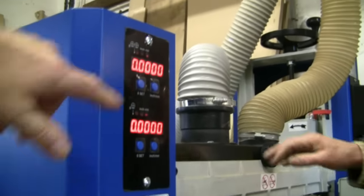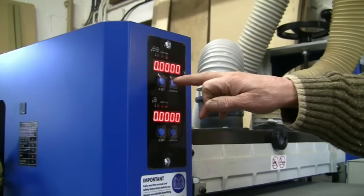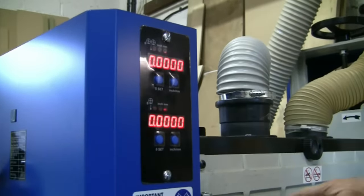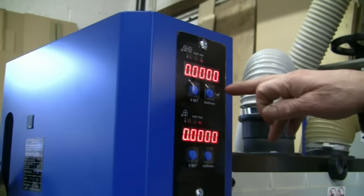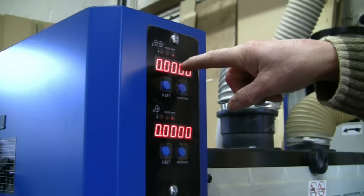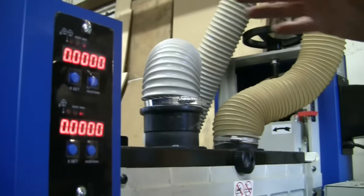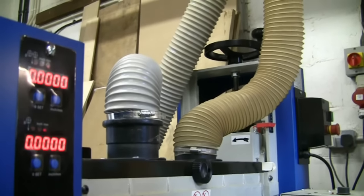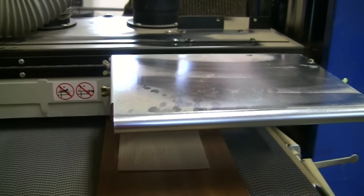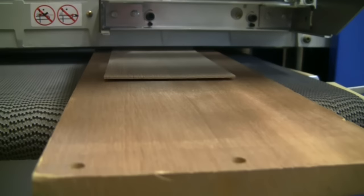What's going on here Andy? This is a very accurate digital readout. Once you've established a datum and measured the thickness of the board, you zero the digital readouts, then you can take off a very tiny fraction in each pass. It's possible to feed multiple components through, reset the machine, and know exactly how much you're taking off — which is great for thicknessing veneers. I feed them through on a carrying board and can accurately thickness them down to a millimetre and a half or even less with care.